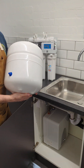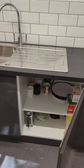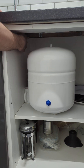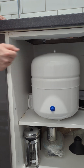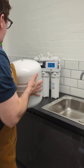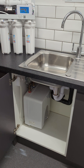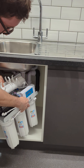If that is the case, you can simply locate your tank in an adjacent cupboard. Just under here, it would work quite nicely. The tubing would then come up — there's usually a little gap here between the units. If not, they're very easy to just drill a hole straight through and push the tubing through. The main unit will then simply sit under here, because this is where it's going to connect to the cold water supply and also to the drinking water tank.